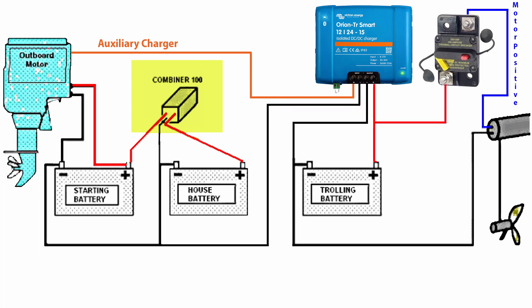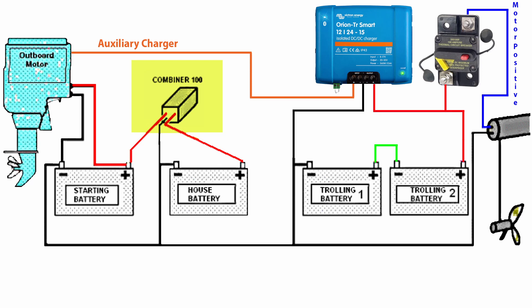The next diagram is much the same setup as far as the batteries and combiner go. The main difference is that this one is designed for an isolated circuit, where the ground system is different between your 12 volt batteries and your 24 volt batteries. You'll notice that the 24 volt ground only goes to the 24 volt battery and the trolling motor, whereas the 12 volt ground is common between both 12 volt batteries. The next one shows the system set up with a pair of 12 volt batteries — if you've got a pair of 12 volt lithium batteries, you can set it up this way. It's just a matter of connecting the two batteries positive to negative and treating them like one big 24 volt battery, with a common ground between the 12 volt and 24 volt systems.